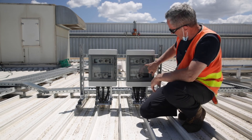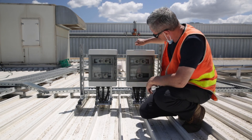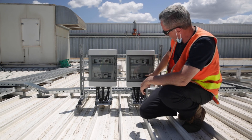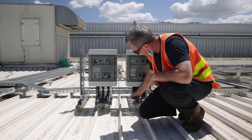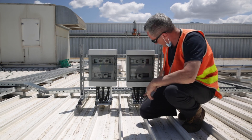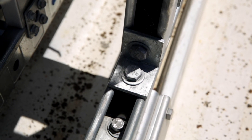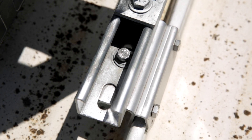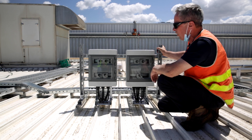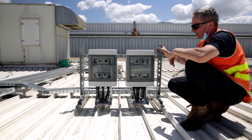In this particular enclosure there are three isolators and in this one there are four. I haven't really gone into the nitty gritty of the design side of things, but you can see the cables coming in and the returns coming out. It's built on a unistrut platform — very robust, really heavy duty. Where they've positioned it is fairly close to the walkway so in a safety or emergency situation the isolators can be turned off quickly.